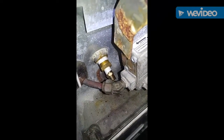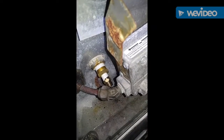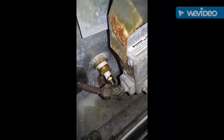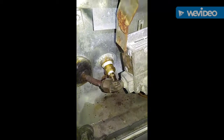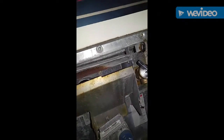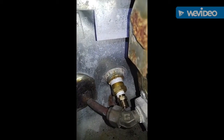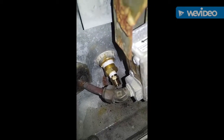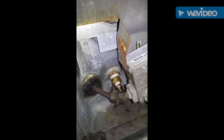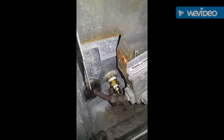The second reducer is now going on, which has the compression fitting for the heating element. I've got a gear wrench for this but I can't get it in there, so open end it is and it's going to take me a bit to get that threaded in there. The tool list so far has been a pair of adjustable pliers, a 22mm, a 14mm, and then for the compression fitting it's going to be a 16mm — and this is for the Atwood. I'm unsure about the sizes for the other ones but the instructions probably cover that. Let's do the compression fitting, then I'm going to turn the water on, bleed the system out, and make sure I've got no leaks before I go to the next steps.